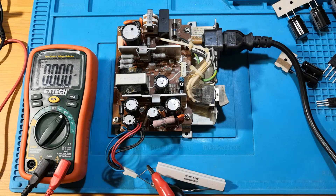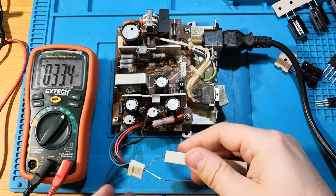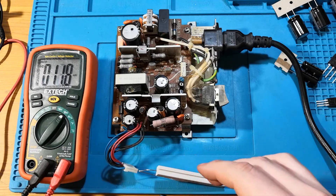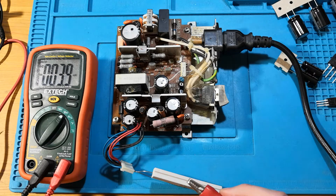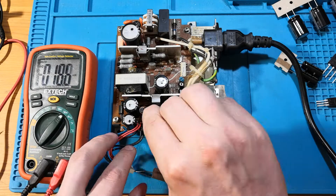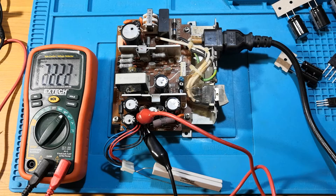So we've got the other resistor in — let's see what happens. 6. Okay yeah, this is not happy. If the power supply can't do that, that's not good. And that's not even warm. So let's see what happens to the 5 volt whilst we've loaded that down. Can I clip onto it without shorting anything out? So I've clipped directly onto the power supply — let's see what the 5 volt is doing. 3 volts! Yeah, this power supply is knackered.